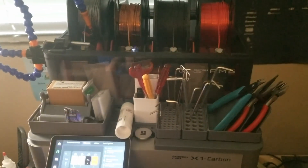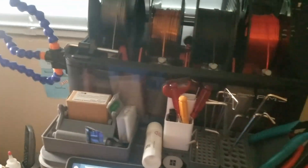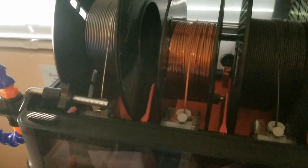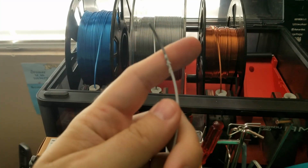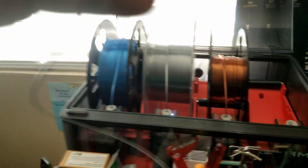Now the problem that I was seeing was twofold. First of all, in the first stage feeder, it would sometimes report that it was out of filament when it still had filament in it — unless I took the filament and kind of pulled it to the right, and then it would recognize that it had filament in it. Another problem was that, especially in the first and fourth stage feeders, it would sometimes feed in a bunch of filament and then get stuck. The feeders would chew a hole in the filament — just absolutely gnaw the side of that filament — and it wouldn't feed anymore.